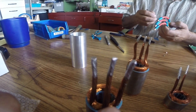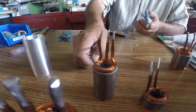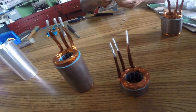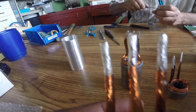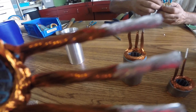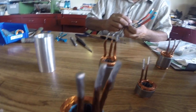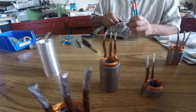People, don't ever cut this off and try to make your wire shorter, because you can't solder to it. That's why I make it this size — because at this size, they're not going to cut it because it's too short. If I make it a little longer, I run into the risk of somebody cutting it. So now you guys know why the wire is so short: if you cut them off, you can't re-solder to it. You have to put that special material on there. I've got a couple of customers that have to send the wire back to get it stripped again and just put the solder, because you cannot solder on that copper at all without that.